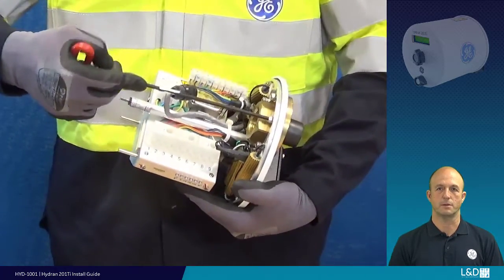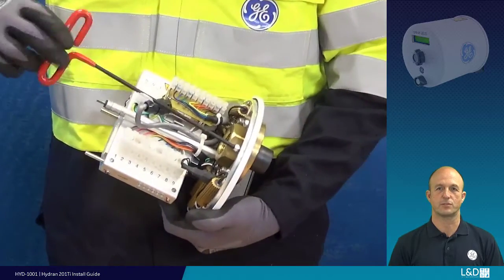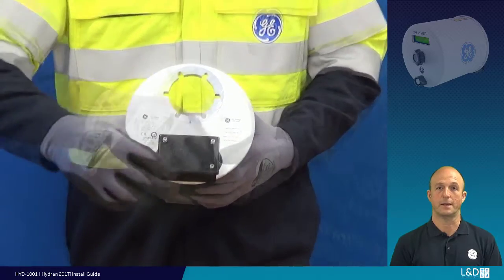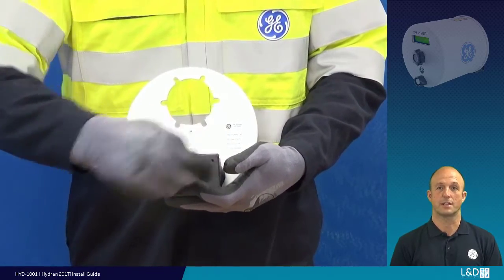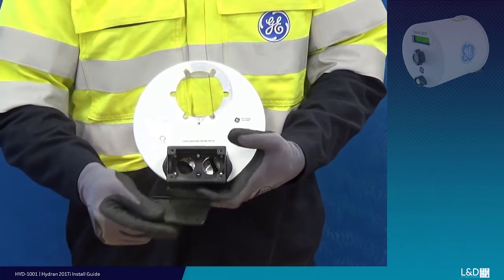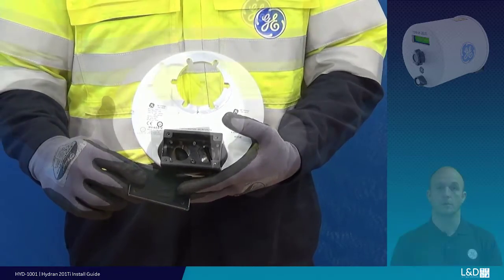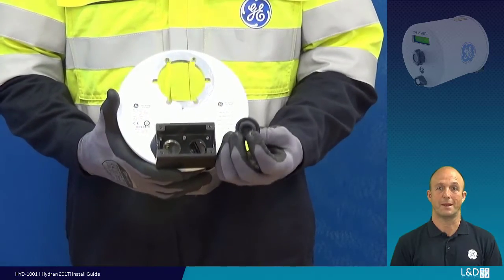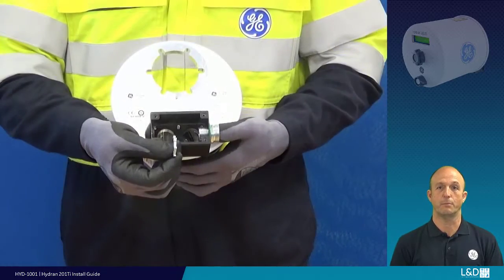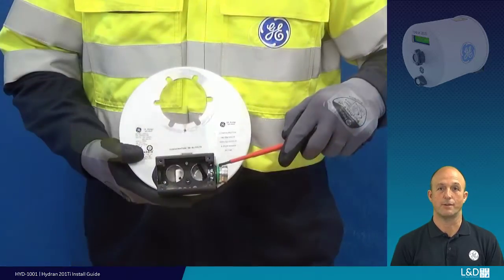Here is the sensor serial number — this must match the sensor parameter sheet supplied by GE. To install the Hydran, the brass adapter must also be removed. Use the supplied tool to remove the ring of six screws from the base plate. To install wiring and conduit to the base plate, remove the box lid. Retain the screws and internal rubber seal to maintain the system IP rating. Remove the necessary number of conduit blanking plugs, fit the correct diameter conduit connector into the available port and tighten correctly — ensure the seal is present and correctly compressed.